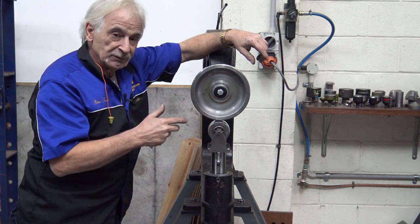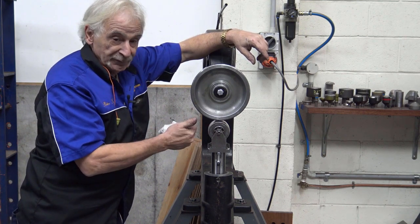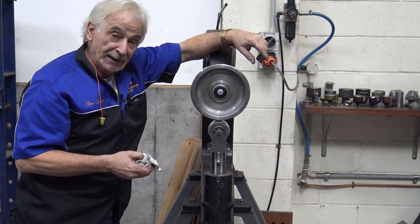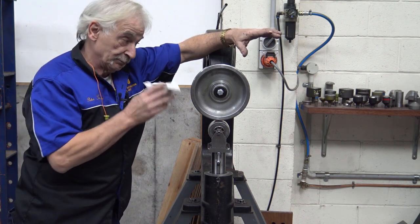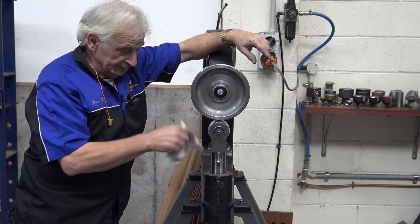It's more important to have a smack on the hammer, obviously, because you want the hammer to hit straight. But the fact that this is a mil and a half, 2 mil further out, is really not a big deal, because you can still wheel in the center. But I thought I'd mention that. It all depends, of course, on how much material they took off the casting. Some castings are pretty good, some they've got to go in further. So I mentioned that, and we go from there.